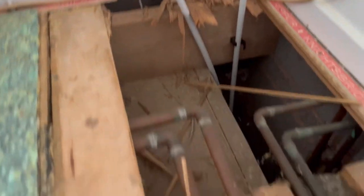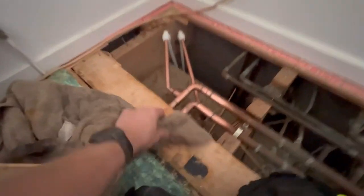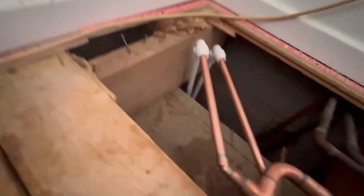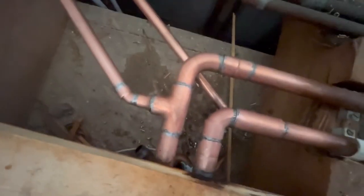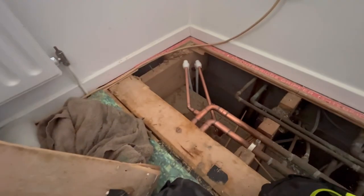So that's where our speedfit comes up. I'm going to put another clip in there for that one — that's our flow return. So I'm just going to chop them, put some T's in, connect up over there and that is done for the day. There we go — I've just got to clean up these joints. That's it connected on the flow return. Just come across there to pick up the speedfit. I've got a clip there but it doesn't reach — I can pack that out, get another one there. That there is actually off a Baxi 800 — I didn't use the preformed pipe, I kept it — look at that, fitted nicely in there. But that's the flow return — get these boards back down, fill it up, test it, that should be good to go.